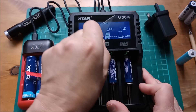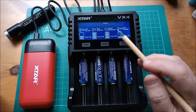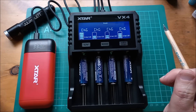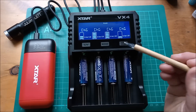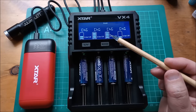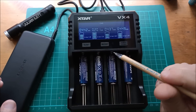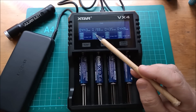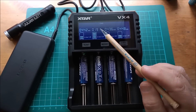While it's doing that, I might as well peel off the display protector. These four cells are still charging — pressing the middle button shows the charging currents. You can see this one has gone a little lower, down to 385 milliamps, while the others are around 440 milliamps, so this one is approaching full charge as the current is being tapered down. The battery indicator on the display hints at this — it's showing one bar full, and I have a feeling this goes up to two bars full with the top bars animated. Now with the current for this cell having dropped to 200 milliamps, it's actually showing three bars full and only animating the top bar.